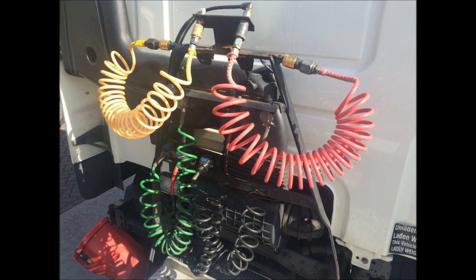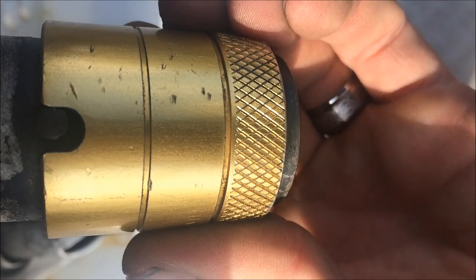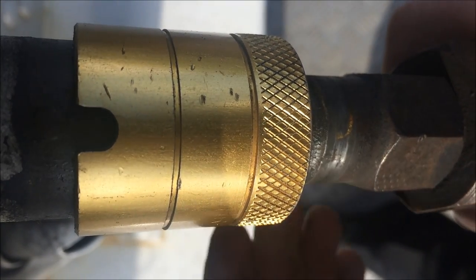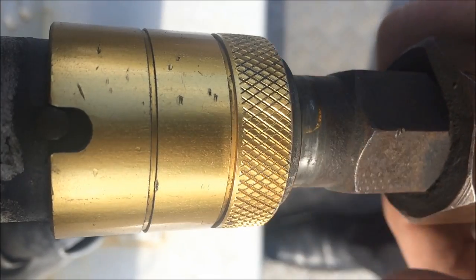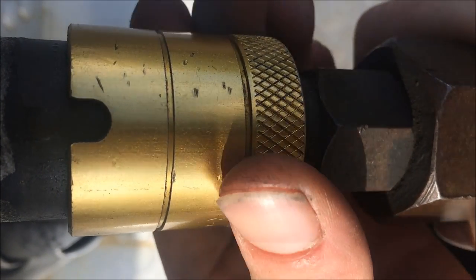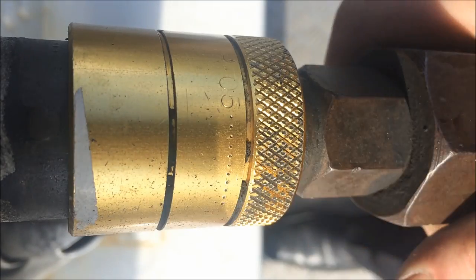For the airlines, we've got the gold collar there — we're locating the pin into the slot. We're going to place the coupling together and pull the collar back, a nice firm grip, good firm push, and there we go, that's locked in place, and we're going to rotate that collar to make sure it's secure.